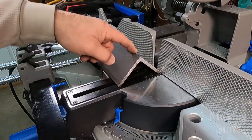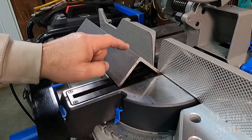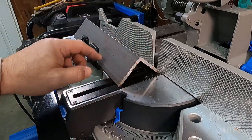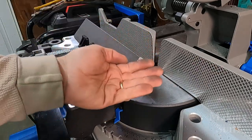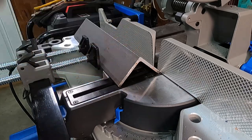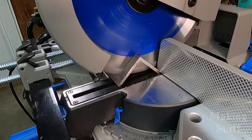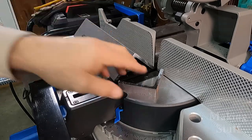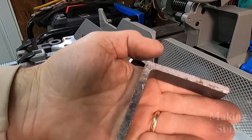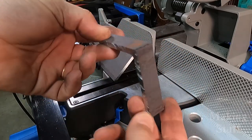I've got some three inch angle iron loaded here and it is a quarter of an inch thick. I want to show one of the nice features of this carbide tip blade — it does not heat the metal up. If I had been using an abrasive blade, this metal would have been glowing red hot when done cutting and there's no way you would be able to pick it up with your hands. So I'm going to cut this and immediately pick it up with my hand to show you the metal is not hot — it doesn't even get warm. As you can see, it's not even hot. I can hold it with my hand — same over here. If this had been an abrasive wheel cutting it, this thing would be glowing red hot.